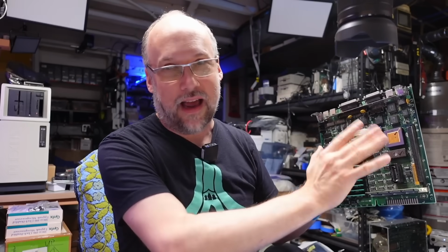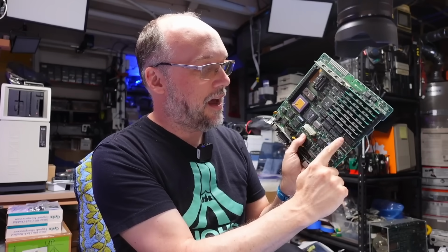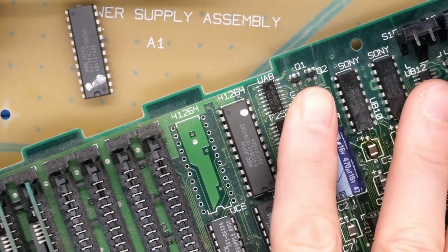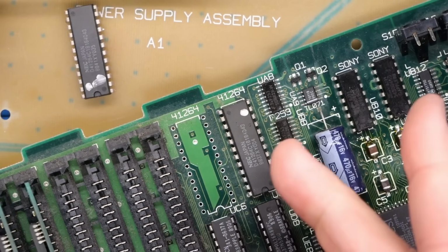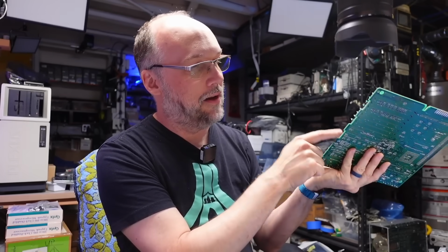So I have lots to cover in this video, and let me first talk about what I meant about maybe not repairing this motherboard. This is the one I worked on, the last one that had the 12 volts through all the different rails here. This board is still exactly like it was where we left off in the last video. The only thing I did do is I had removed this chip here. This is the video RAM chip that was hit with 12 volts. So I took it off the board in the last video, and I've since resoldered it back on while I put some pin headers on there, so it's actually in a little socket there. But otherwise, I haven't really done anything with this board. It is still not working.